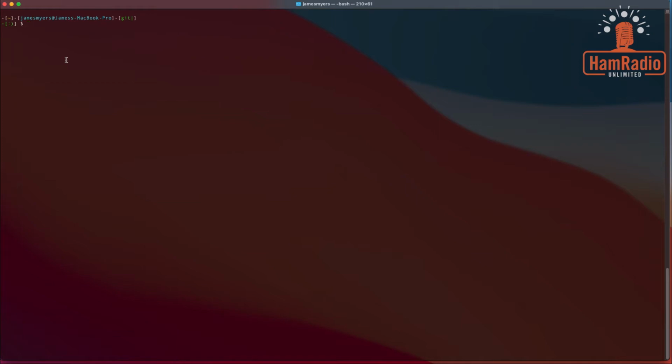If you're on PuTTY, you're going to have to start PuTTY. It will ask you for the IP address and ask you for the port as well. The port should default to 22 in PuTTY, but the answer we need is really 222. So we need to change that 22 to 222.